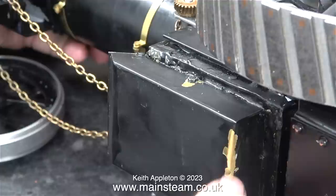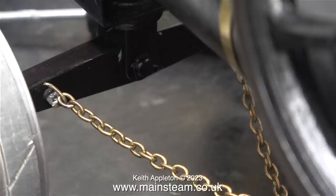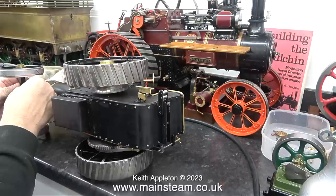When I tapped the ashpan slightly it did loosen up, and so did the paint. This paint has been applied over the top of a shiny piece of brass without keying it — I can scrape it off with my fingernail with hardly any effort. The steering chains weren't installed correctly and were very slack. As I turned the engine on its side, one of the steering chains fell off, so I put it back in position and bent the piece of brass wire so it wouldn't fall off again.